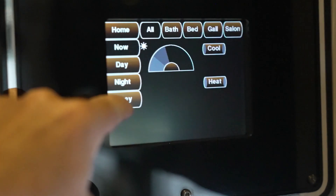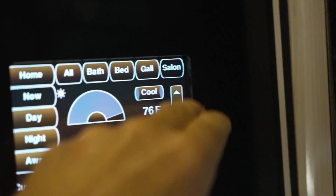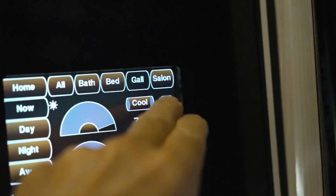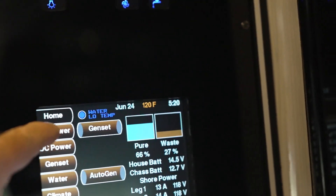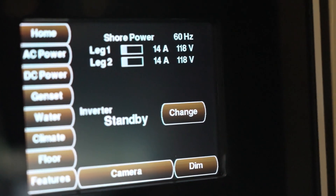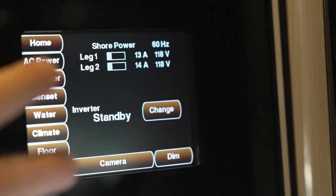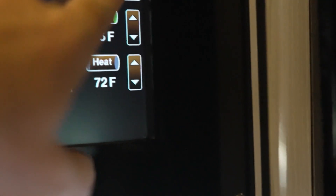I'm going to be careful with air conditioning. I'll turn on salon and galley — so just two air conditioners at once. After both kick on, we're pulling about 15 amps per leg. That single 30 amp service is being divided by two legs, so right there we are maxed out. I'm turning the air conditioners off because when appliances with motors kick on, you get a momentary surge that could exceed the nominal amperage rating, and the last thing I want is to pop that breaker.